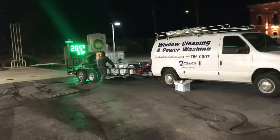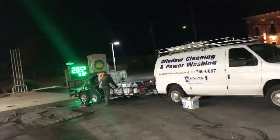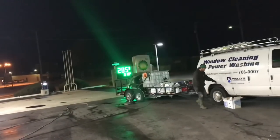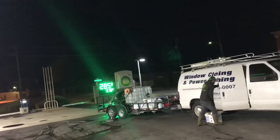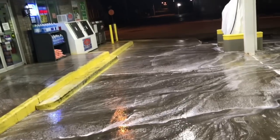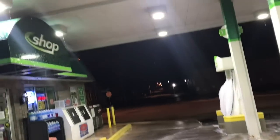So I'm gonna go ahead and rinse this off. Aaron's making me another batch because we're only doing 5 gallon mixes at a time. So again, what we did was 4 gallons of the chlorine and 32 ounces of EBC. Like I said, I'm gonna rinse this off. And we also coated the whole bottom with the same mixture. So this concrete's been dwelling.